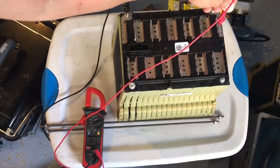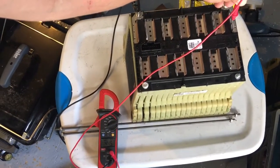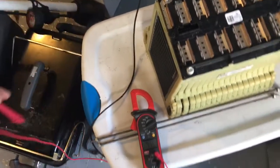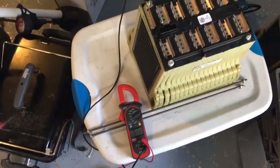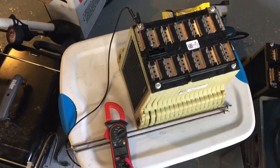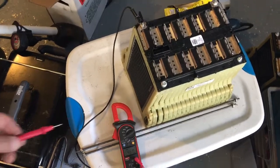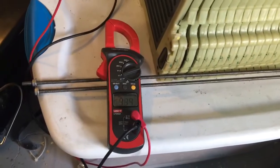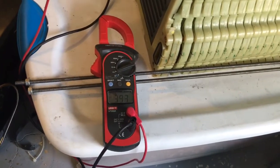The reason some of these voltages are high is because I was trying to balance the battery assuming there were 12 cells, but it turns out there are only 11 cells functioning. The dead one would be the second cell, since the first cell has voltage but the second has none.